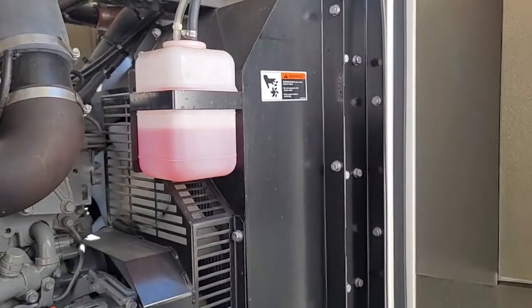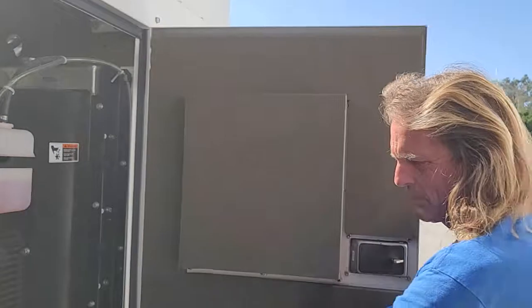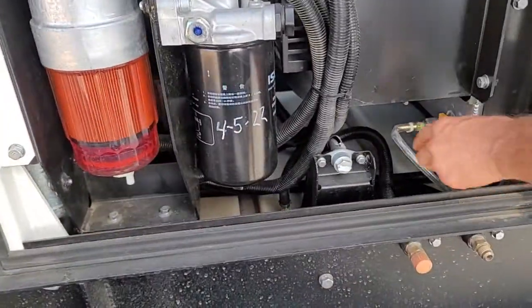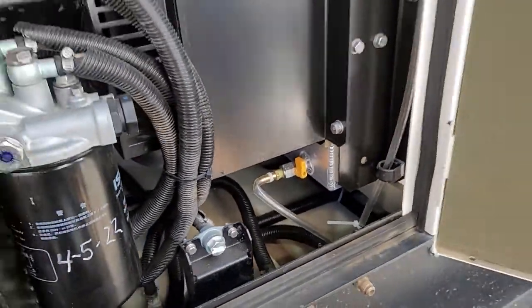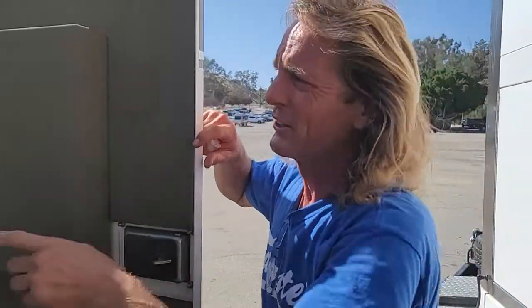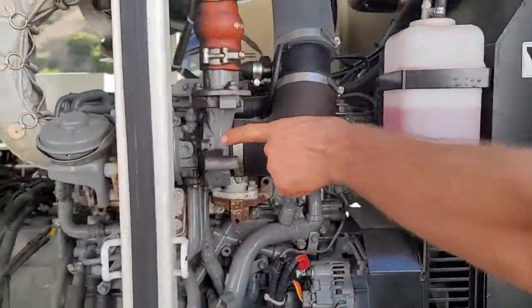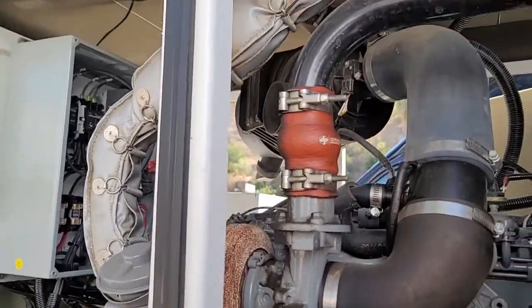The last thing is coolant, right here. You can't really get into this radiator cap conveniently — you have to climb on top. As long as that's good, we're good. Check the service — it's been serviced four months ago. This is a little overflow — oh no, that's a drain line, it's kinked. Little stuff like that, you're just looking around. You're looking at the hoses, looking at this weeping right here. All those things are things you want to keep an eye on.